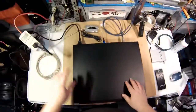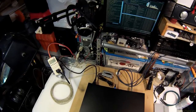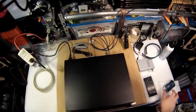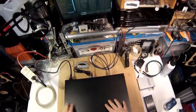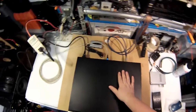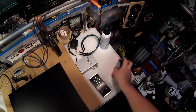Maximum power usage I've seen on this is 13 watts, so it's super efficient. Now we're playing — it's showing 44.1kHz on the front. If I put on something 24-bit, 96kHz, it'll automatically tell you what it's doing. That 96kHz is being upconverted to 192kHz to be put through the DAC and sent out.